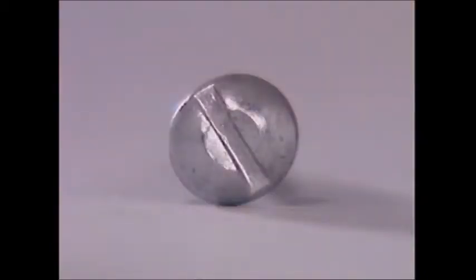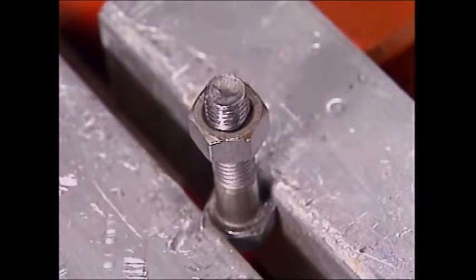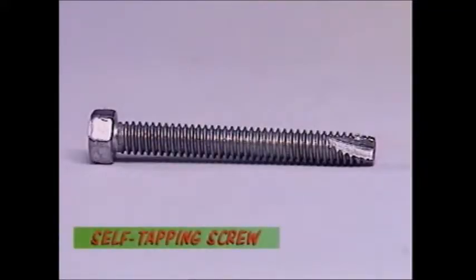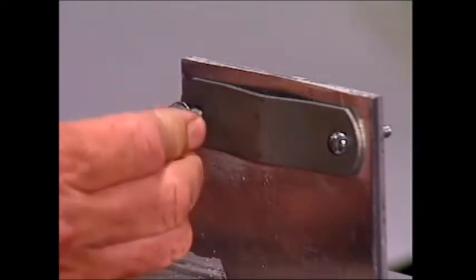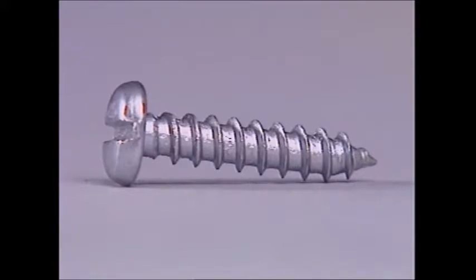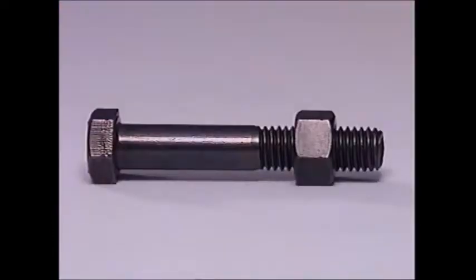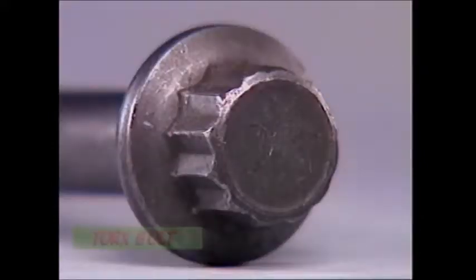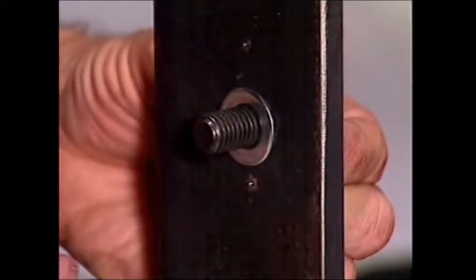This is a machine screw — it has a slot for a screwdriver. Bolts are always threaded into a nut or hole that's got an identical thread cut inside. A couple of special screws cut their own threads as they go — this is called tapping of thread and this is a self-tapping screw. It's made of hard material that cuts a mirror image of itself into the hole as you turn it. Another type of self-tapping screw is designed for cutting and holding thin sheet metal and is often used on car bodies. Bolts are often bigger than screws and are used for heavier jobs. They nearly always have hexagonal heads that only fit spanners. Often the thread on a bolt is only as long as it needs to be to tighten onto the nut or into the threaded hole.